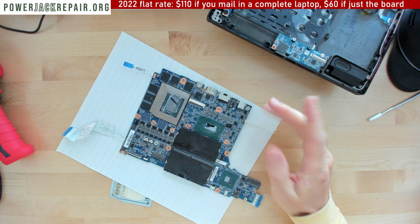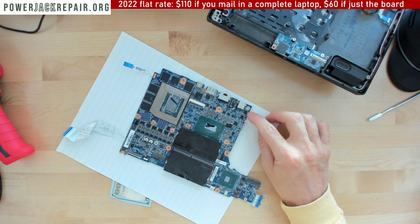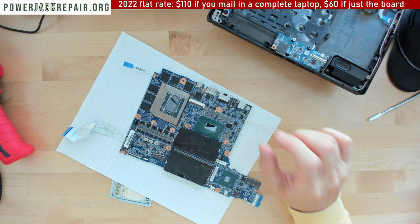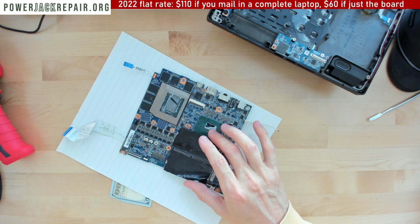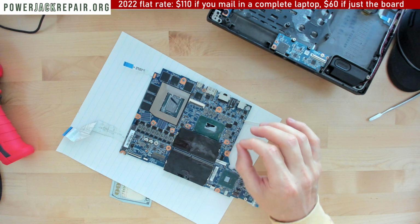This guy overheats, not because it's faulty, but simply because it finds a short. If this guy wouldn't be overheating, I would think it's a power supply issue as well. But because this guy is heating up, it's heating up because it finds a shortage someplace down the road, which I can't see on the thermal camera because it's not a constant shortage, it's like a variable shortage.